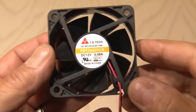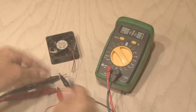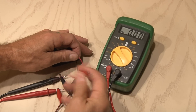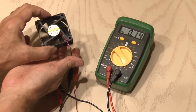This needs to be a 12-volt brushless fan that draws less than 0.10 amps. We're going to need some alligator jumper clips for this next step — if you don't have any, you need to pick a few up. To make sure this fan works for the project, we're going to use our multimeter. Using our alligator jumper cables, we hook up the positive and negative from the fan to the multimeter. Just by spinning the fan blades, we're generating voltage.